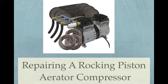You may also hear the sound of the compressor change a little bit. If you see this, it's important to turn off the compressor and not run it if this occurs. If it goes long enough, internal damage could occur to the piston and the piston chamber.